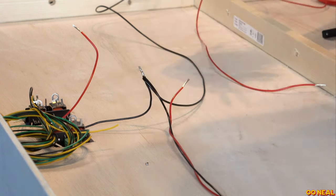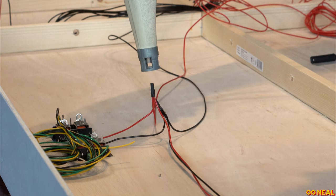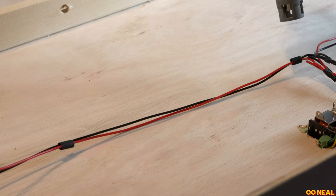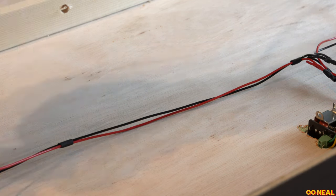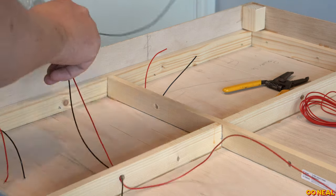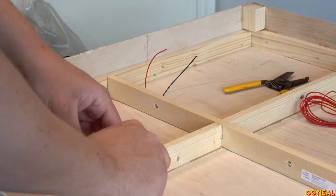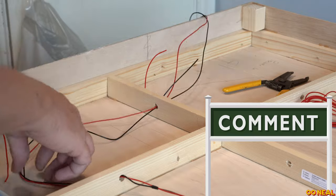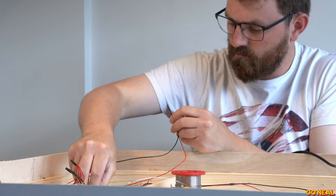Sometimes terminal blocks are hard to get everything in and don't always work, but they'll be absolutely fine if that's what you're using. Soldered connections are generally the strongest and the best — they'll stay there. And if I want to change anything, I can re-cut wires. I've left enough room in the wiring. If you're ever doing the wiring, don't make everything tight — give it a little bit of bagginess so you can allow the wire to go to a new position if cut. I always try to have a little room for adjustment for later on.